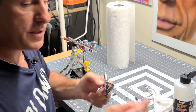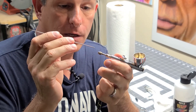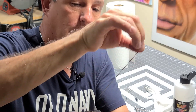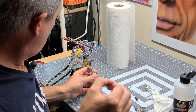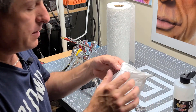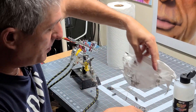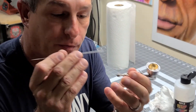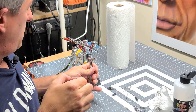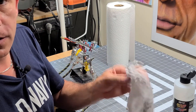So now here's the trick: you take your needle and you're going to run your needle in backwards. Here's your pointed end, here's your flat end — you're going to run your needle in backwards through the gun. More times than not, when you think it's clean, when you do this you get some black residue. What that does is it helps pull any remaining remnants of paint through the gun. I usually run it through twice, wiping the needle between each time. If I'm wiping and I don't see any paint or residue, I know I'm clean.